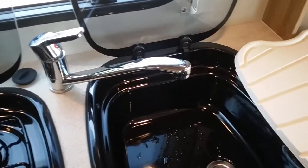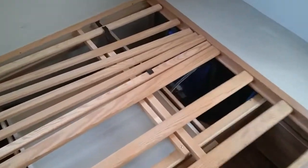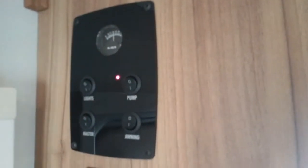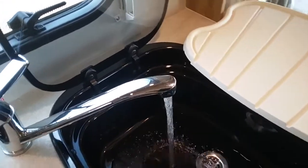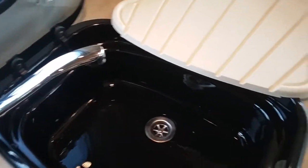When it comes to refilling the boiler, close all the taps, reclose the drain valve, fill up your Aquaroll, drop in the submersible, and then turn on the water pump, and the water pump will begin to refill the boiler back up again. Let the pump run for a few minutes and then begin opening the taps. They'll cough and splutter as they force the air out. Once they're running freely on both hot and cold, reclose, and then the system will fully reprime itself.